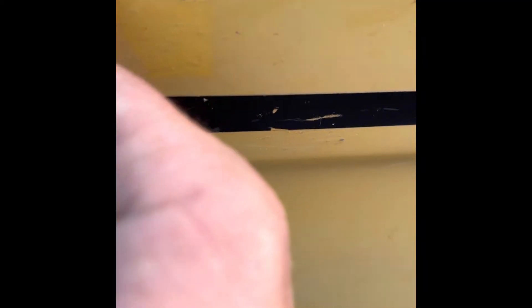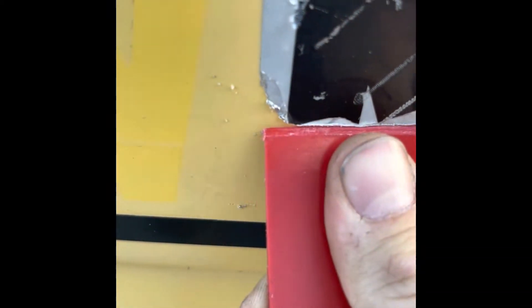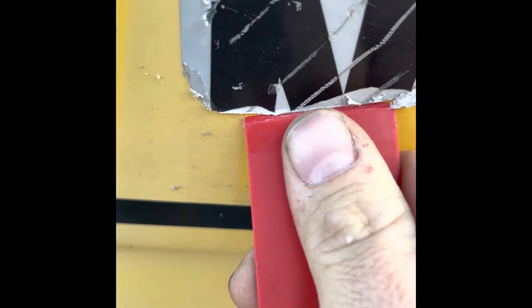I've been using this little three-inch plastic putty knife. The key — because the rest of them come off pretty easy — is to keep the edge as sharp as you can. It looks pretty bad on camera but it's pretty sharp. I use a regular flat file to clean that edge up, and once I did that it started peeling pretty good. I find it best to use a rocking or sawing motion. You can see it's starting to already form an edge, so I'm going to keep going at it.